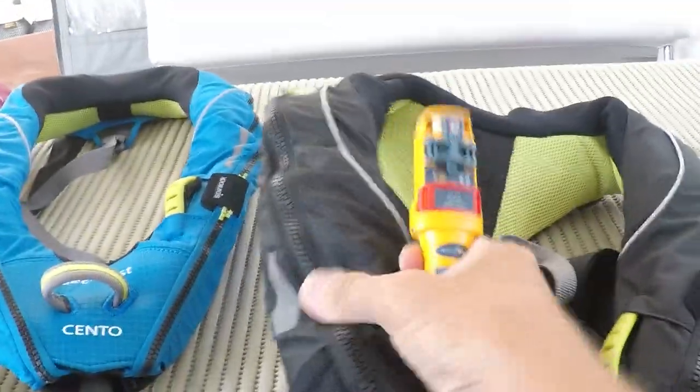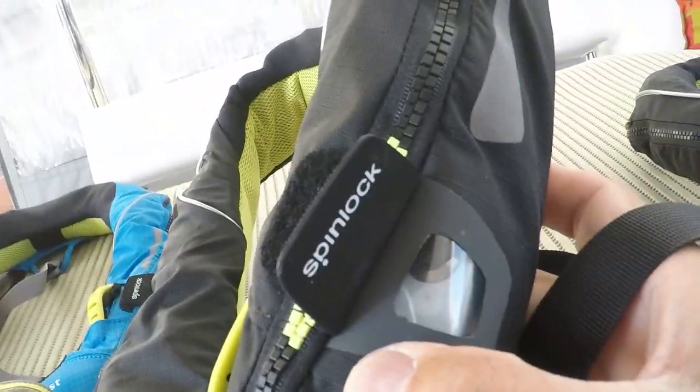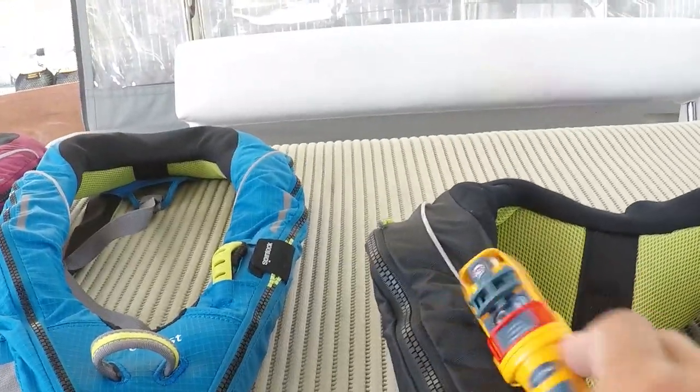The MOB must go in where the inflator hose is, so it's going to be on this side, on the inside. On this side is the trigger mechanism, and if you can see, there's a trigger mechanism for the inflator. I'll be installing them on this side, so they'll be somewhere in here. Let me show you how to do that - a good point to start is, of course, with the manual.